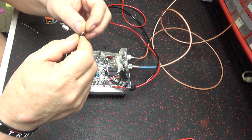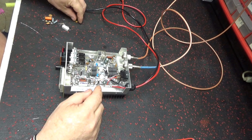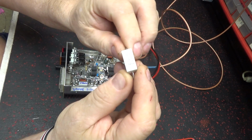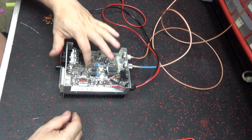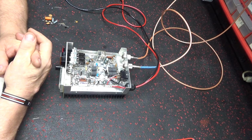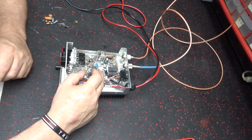Somebody had took this wire and shoved it down through there, and that was, I think, making contact with the board. This was in there, and you can tell this was cut and spliced and put in there. It is a 75 ohm 5 watt sandbar resistor, which this took the place of it. This is a 65 ohm. I didn't have the book calls for, I think, 78 ohm or something other, but I put a 65. It'll be fine.